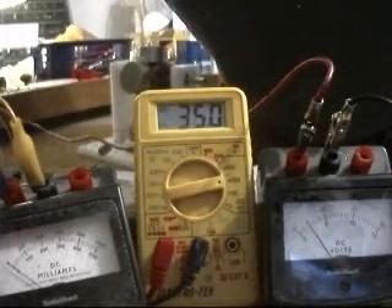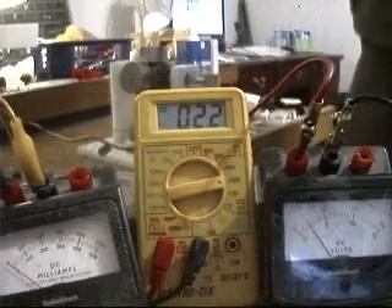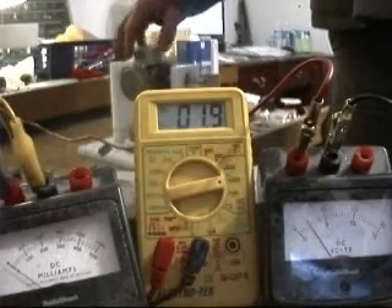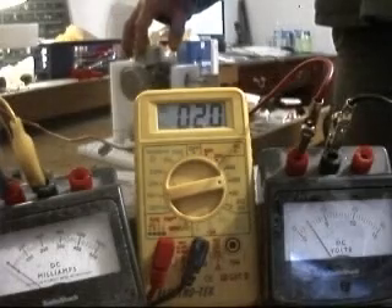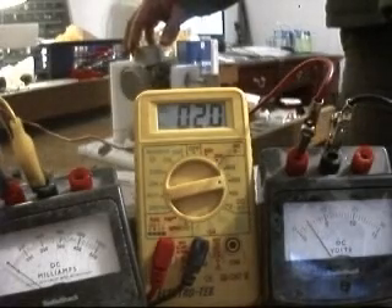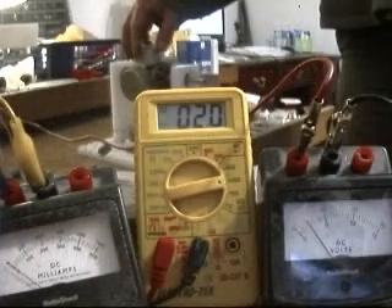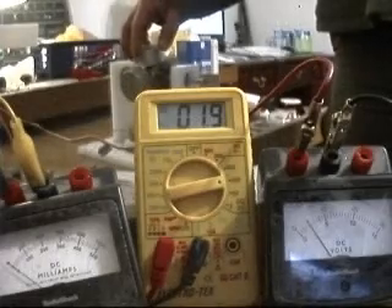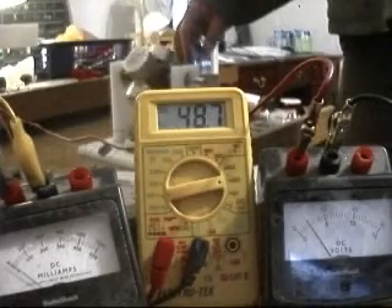I can short that out, or back to the 2 volt input. The motor has to turn slow enough in order to let the magnetic field build up within the coil. Once that magnetic field collapses, that's where we get the voltage from.